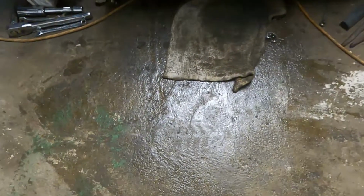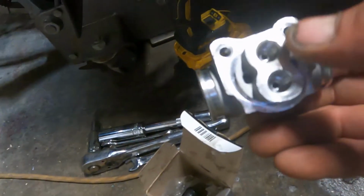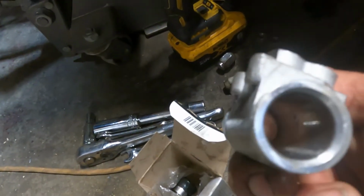Alright, so I made this mess. The wheel cylinder they gave me was the wrong one, so we didn't have a bleeder hole, it had two brake line holes. So I just took the other cylinder and cleaned it up a little bit better and put the insides of this one inside of that one. And hopefully it stops leaking. We'll see overnight, and I'll get some brake cleaner tomorrow and clean them up. I forgot to get a can and clean up this mess, but we'll see.